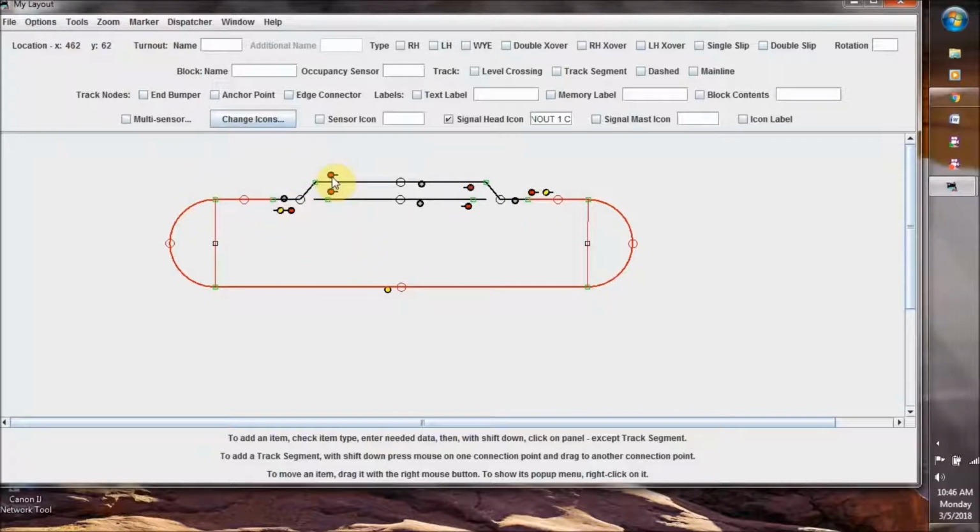Same in this direction. If there happens to be a train in that block, then this will go to red. You cannot go from this block to this block. It's occupied. And because these signals are protected, if a train is coming along here and it wants to go onto the siding, again, yellow says next light will be red, and it's red.